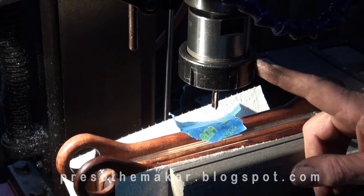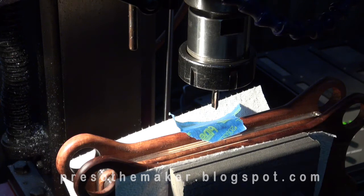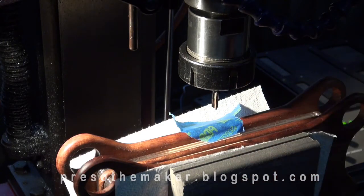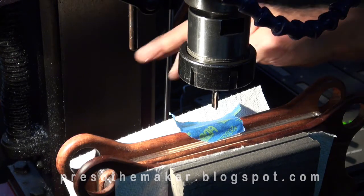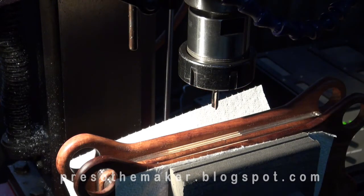So I'm going to run my spindle as fast as I can go, which is about 2,500 RPM. And hopefully just taking light cuts will be good. The bit that I'm worried about is when we get close to the acrylic, you know, whether that's going to chip. So I'm also going undersize on the diameter, and once I've got the center cleared, I can go around just doing a profile and just keep increasing it, you know, a tiny bit at a time until I get that ring to just fit. So wish me luck, this could all end really badly.